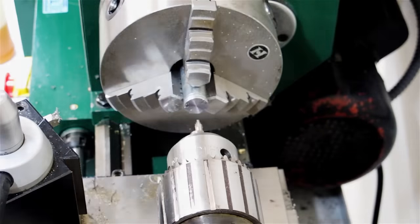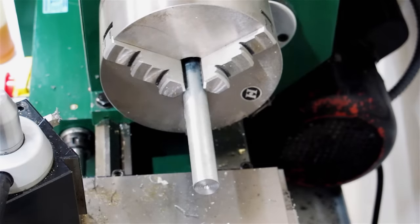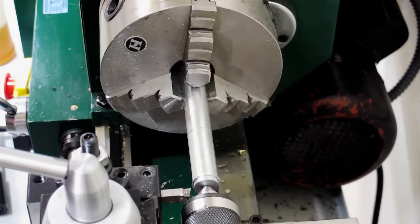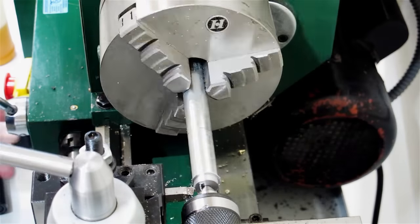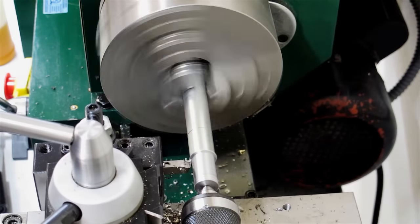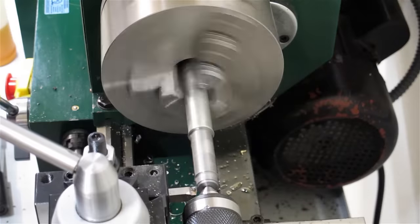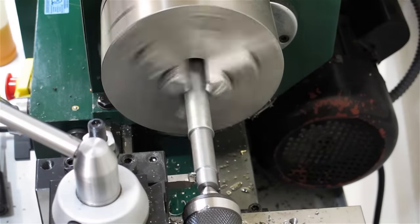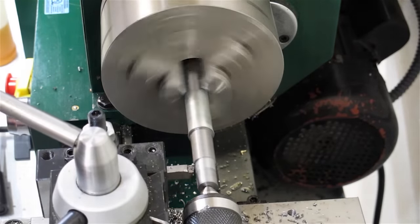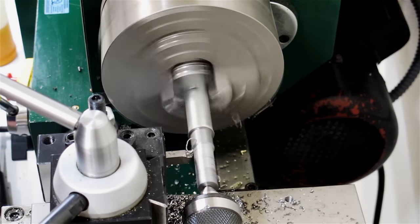At this point, I should mention what many of you already know, but some may not. Whenever you do milling in a lathe or in a mill, the tool you are using must be held in with a drawbar. Generally no drawbar, no milling. Some people try milling in drill presses and other tools without a drawbar and often find their end mills walk out of the machine. Milling puts large side loads on the cutter versus drilling and boring, which is an axial load. Thus, drill presses don't have drawbars.